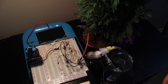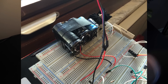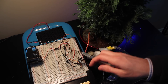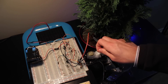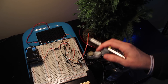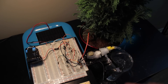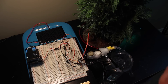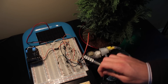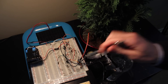Here is the circuit. The way this whole thing works is the solar panel charges up a capacitor bank to a certain level, and when that level is reached, power is turned on to the soil moisture sensor. The soil moisture sensor has a little fork that plugs into the soil, measuring the resistance across the two prongs. That's fed back to a little module - I'll put a link in the description. The cap bank charges all the way up to a certain level, then power is switched on to the soil moisture sensor.